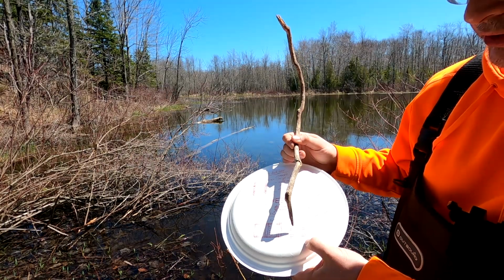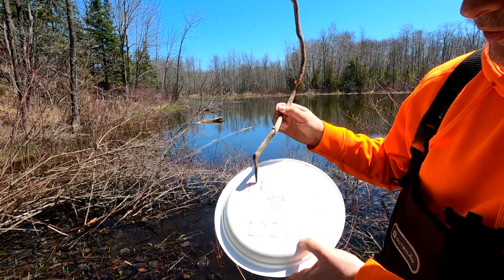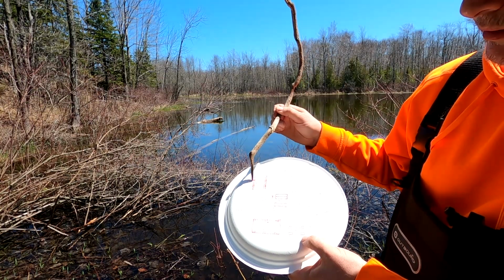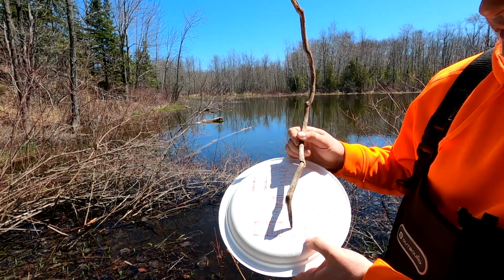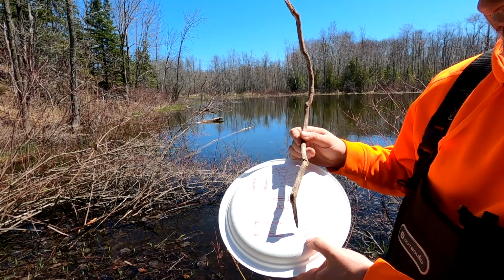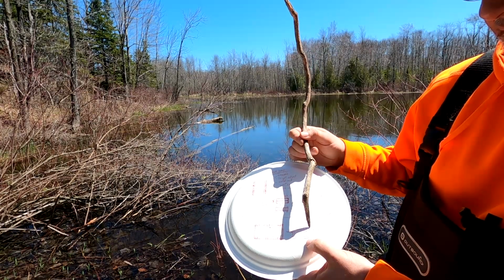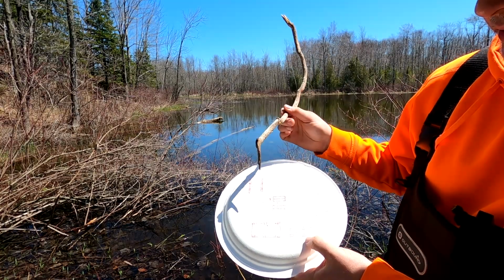Each of the 4x4s coming up is going to have a cross joist underneath. With this system, you have to bring the joist out. The dock fits on the inside. With this system, the dock is just going to fit straight on top. So it covers up the posts. I'm not going to have posts. It covers up all of that and you just see dock. I'm going to have one post coming up.